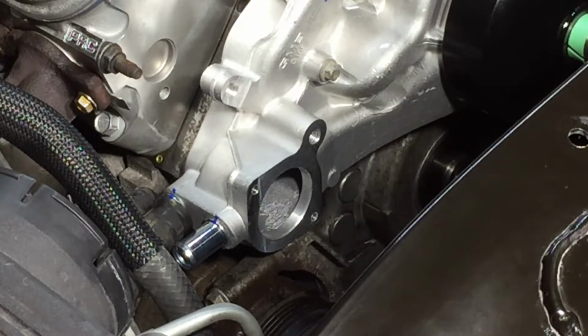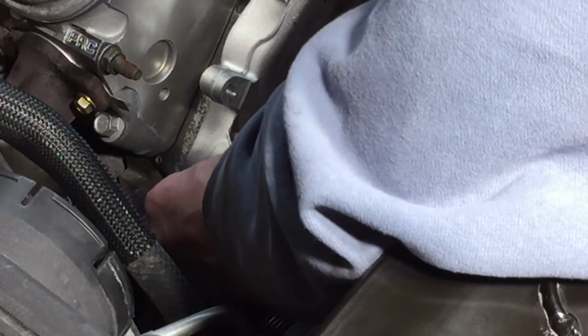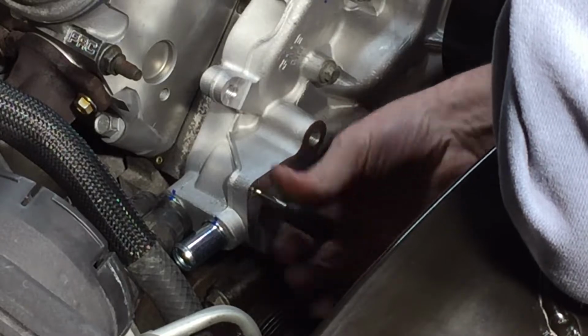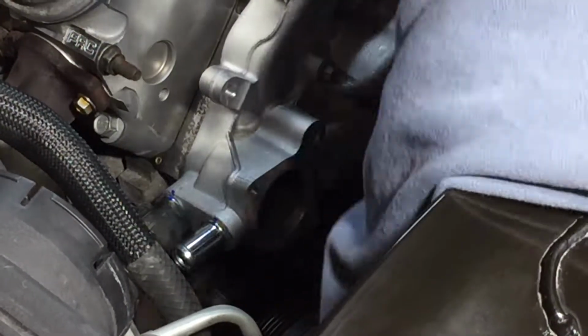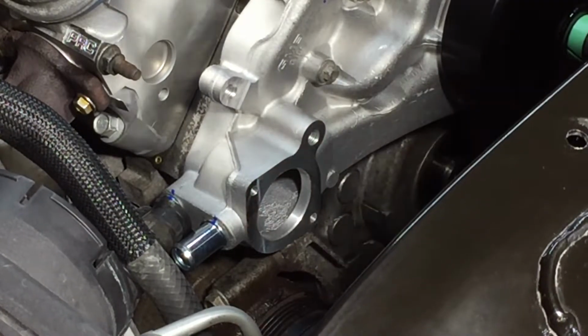Those holes are crappy. We're gonna have to tap them out. Actually, it feels like it's on a little bit of an angle, and the casting looks like a crack, but it's not. So I had a big booger right in the front. Water pump casting. Need a little bit of help with the threaded holes. It really does pay to run a tap through those holes if the bolt's going hard. It doesn't pay to just ram them in.